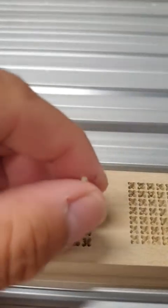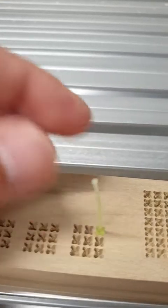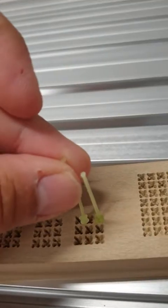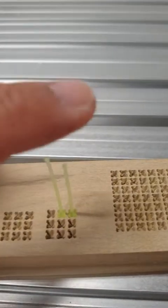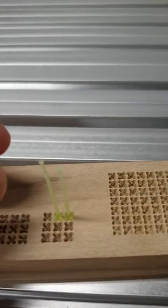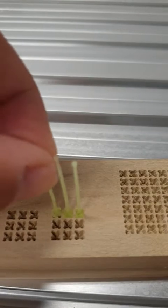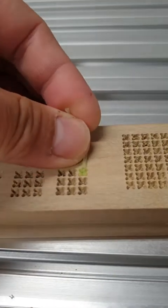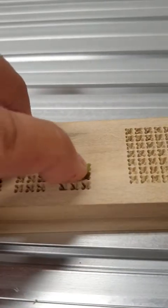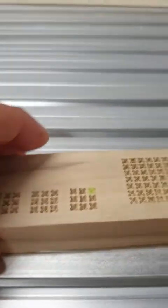I designed these inserts to fit exactly in the pockets and to have enough squeeze out after I glue it in to make sure it's in there. And so I'm wondering, why do I have this sticking out? Well, one, it's so I can actually grab it and place them in the cavities or pockets here. Once I'm done gluing them, I can break these off and leave this in. You see that's a 1 millimeter height sticking out. After it's glued in, I can just sand this down.